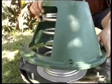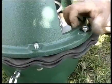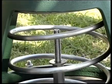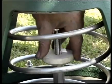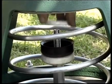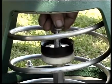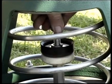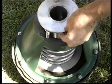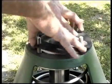The large return spring is fitted over this. The cylinder support housing is fitted and fastened with nuts. A washer is fitted over the piston rod, then a rear cup support, leather cup, inner cup support, fastened with a washer, spring washer and nut. A piston bore fits inside the return spring and a gasket and cylinder head are fitted.